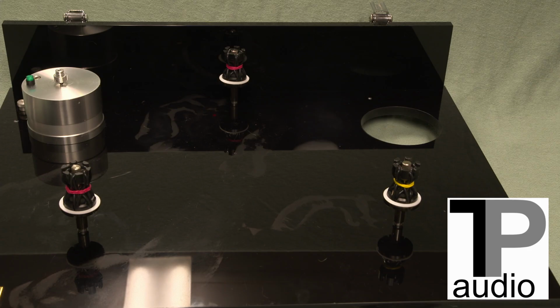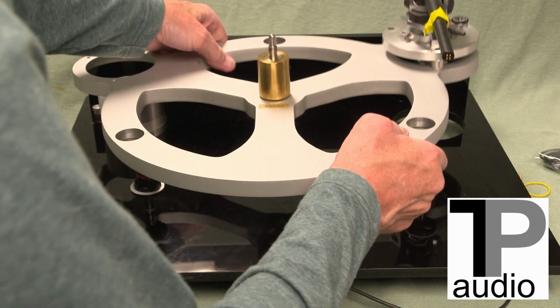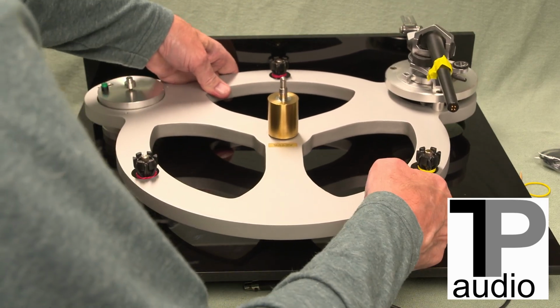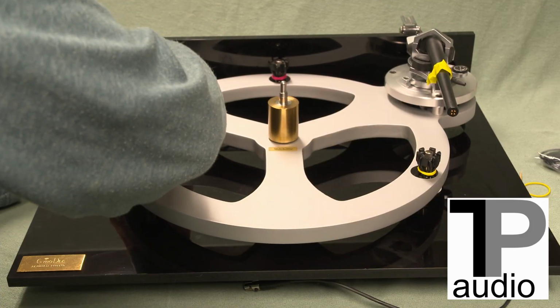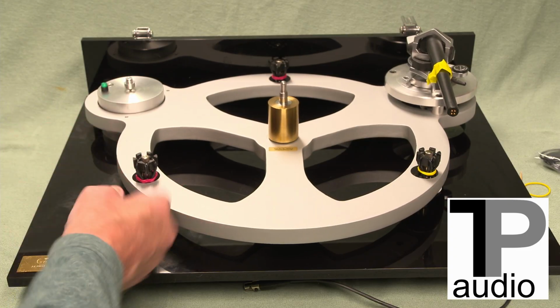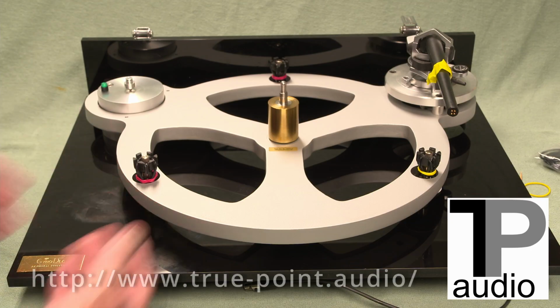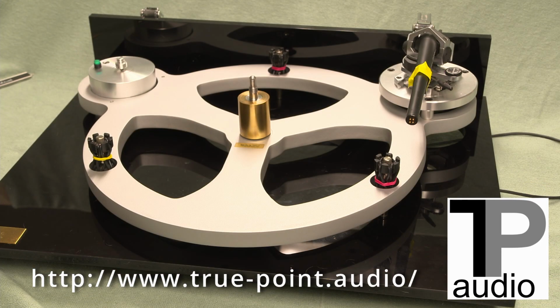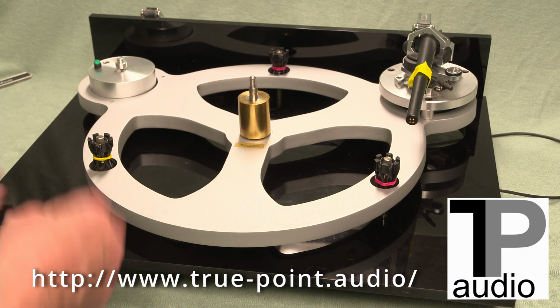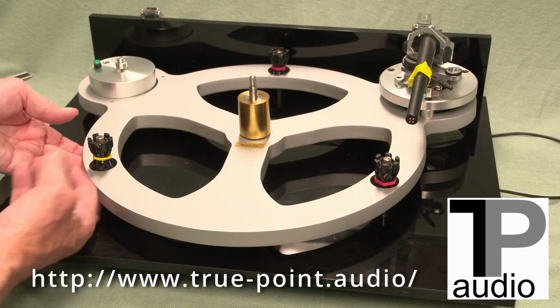Now we are ready to drop the spider back onto the new pylon suspended gyro deck. Now you simply lift over, and instead of bouncy springs, all of a sudden you have a very stable suspension system. Now you need to reach underneath and be sure that all of those, the pylons and the washers, are flush. So you seat those washers on top of the towers before you insert them underneath. You might need to jiggle them a little bit to seat home, depending on the fit, but all of these should ride flat underneath. You shouldn't have anything protruding underneath the spider.